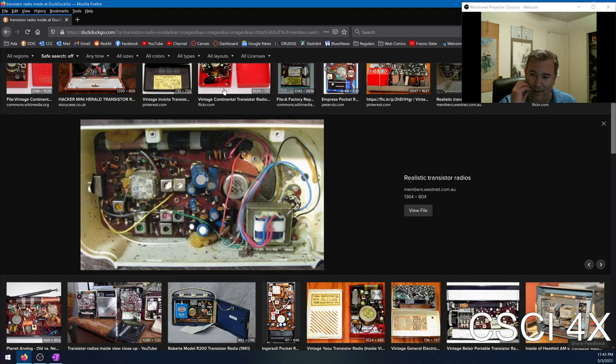It was interesting to me. Like the original Nintendo Entertainment System, if you unplugged it and hit the power button, it would actually turn on for a second, and then it would turn off. It's like, wait, how does it have power without it being plugged in? It's because there are capacitors on the inside. When you hit the power button, it discharges into the circuit and there's enough current for the light to turn on briefly, and then it turns off again.